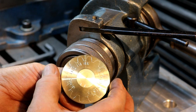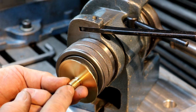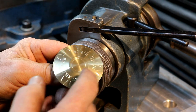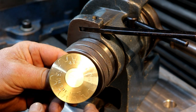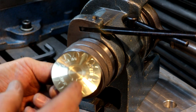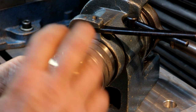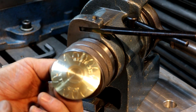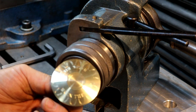I had some big brass stock about two and a half inches, and we're going to screw this insert in - it has a half-20 thread on the back. We engraved both logos on it: 'Basic Biker,' which is what he goes by, and the shop logo with the gear. This came out really nice - he's going to like it. He saw a picture on Instagram but hasn't seen it in person yet. We'll Loctite it on top of the cap; it'll be pretty flashy.